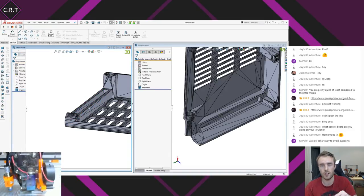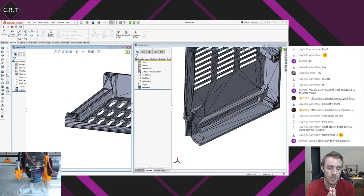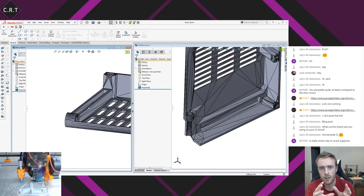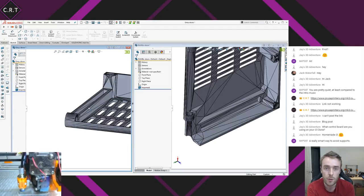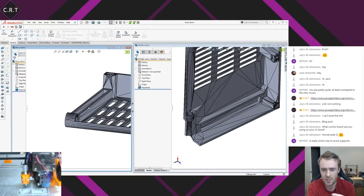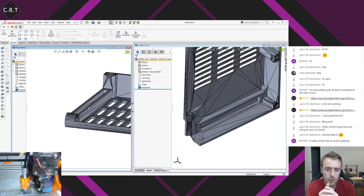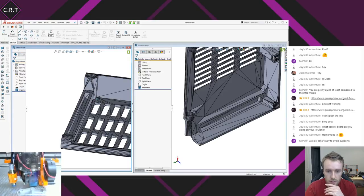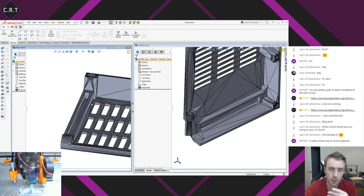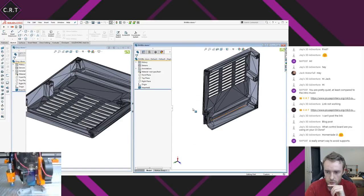But by putting this hole in it, you actually gain two things. So depending on your number of perimeters, a perimeter wall is typically stronger, especially in this direction, than the infill. So by adding wall, vertical faces, you're adding a couple of perimeters, which is increasing your strength. And maybe reducing, or perhaps it's equivalent plastic use, is probably equivalent or less than. So a nice way to get, I don't know how that would affect the print time. Might be longer because there's more perimeters, which are typically printed slower than infill. But yes, that feature is present here as well.